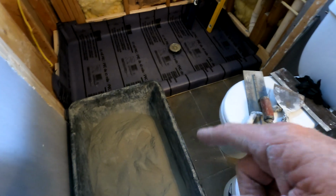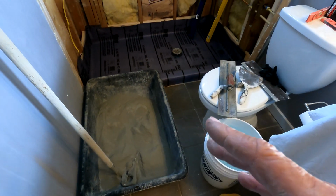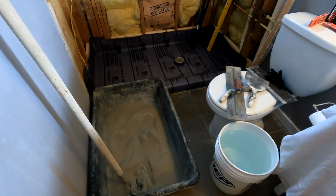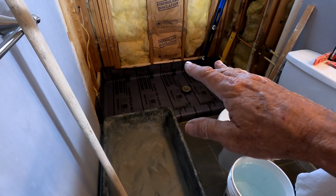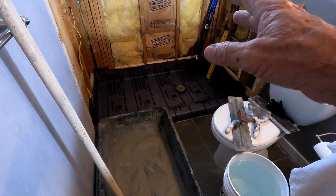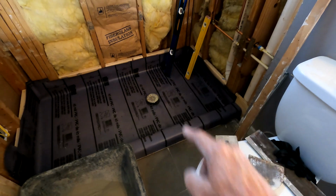Let me also talk about the dry pack. The way I started, I want to end it that way. The dry pack has to do specifically with a water in, water out system. So imagine we were not waterproofing the surface of our pan, which we are now. And the way we used to do it would be water goes in, it goes into the weep holes and goes down to the drain.